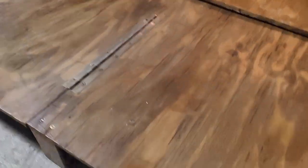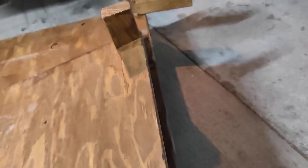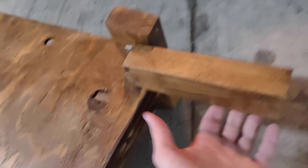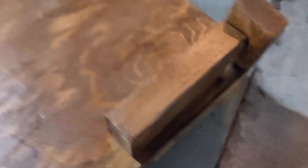This is just half-inch ply, and then these are 2x3s that are screwed on. There's one drop bolt here — the drop pin goes in the bottom and it's just on a simple hinge. You can pack it up like this for storage and it's nice and compact. Once the platform's been removed, you can just take this thing out pretty easily.